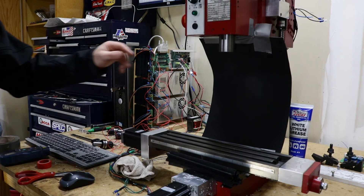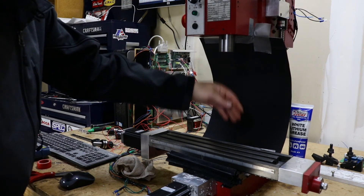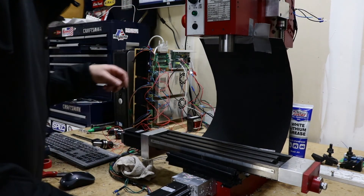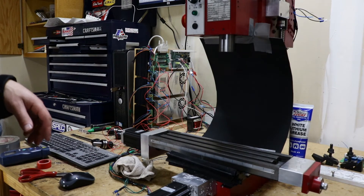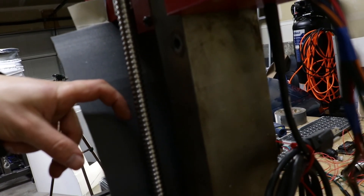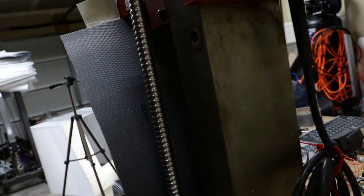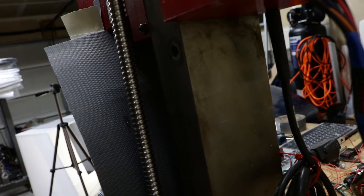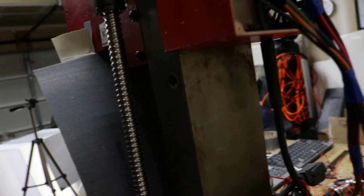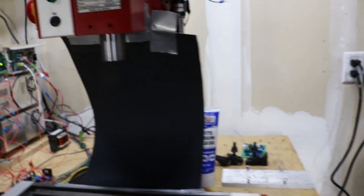I'm seeing that paper holds on here really nicely with duct tape, but this treadmill belt stuff does not. So I will be getting some angle aluminum coming up here ASAP before I really run this mill again to mount that, and then I'll mount it in the bottom in the existing holes. From the back side, you can see the amount of overhang I've got with the ball screw — about two inches. It should keep all the stuff off of it. I can actually see little specks of junk on it right now. There's little specks — that looks like metal. That's no good. It hasn't run metal in a long time. There's all sorts of junk on there; I need to clean it again. If you don't keep it clean, it'll destroy itself.